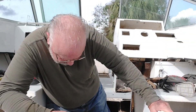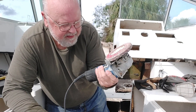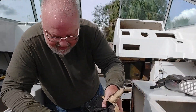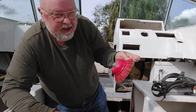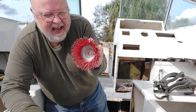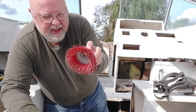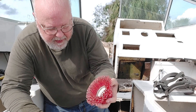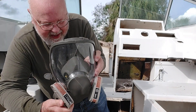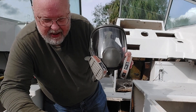We're going to start grinding on the floor here of the Grady White using the angle grinder. And of course with that, I need gloves. I'll also use this brush — it works good to clean the fiberglass. It's kind of abrasive and believe it or not, it abrades it and gets it ready for new fiberglass. And of course, full face mask and respirator — need this. So off we go and I'm going to start grinding.